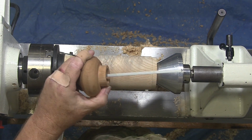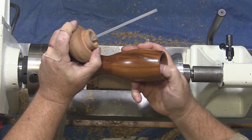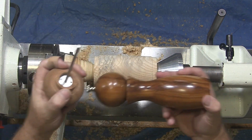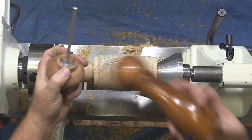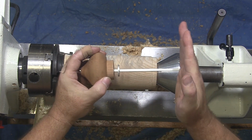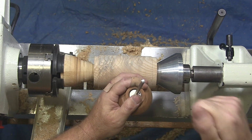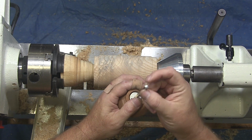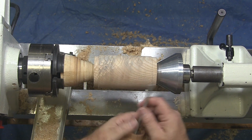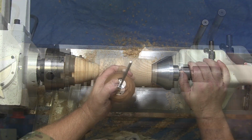But what I do is I go ahead and assemble it, and I let that longer shaft than my peppermill stick out the bottom, and I mark it where it should be. I give just a little bit more play on this end, give it just a little bit more rope. I mark it, and then I take the shaft to a vise, and I cut with my hacksaw at the mark. I flip it around, hold it in the vise, take my ball peen hammer, and re-flange that. And then you can have a 7 3/8 inch tall peppermill. It doesn't have to be an 8-inch peppermill, okay? So that's probably what keeps everybody from turning a peppermill. Any questions?